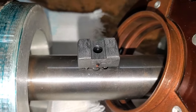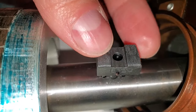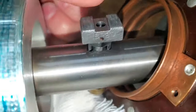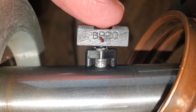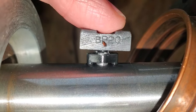There are two separate copper rings, and this single brush rides on both at the same time. There are two wires coming from the stator. One wire connects to one ring, while the other wire connects to the second ring. The brush makes the electrical connection between the two copper rings. Maybe all that was obvious to you, but it took me a while to catch up.